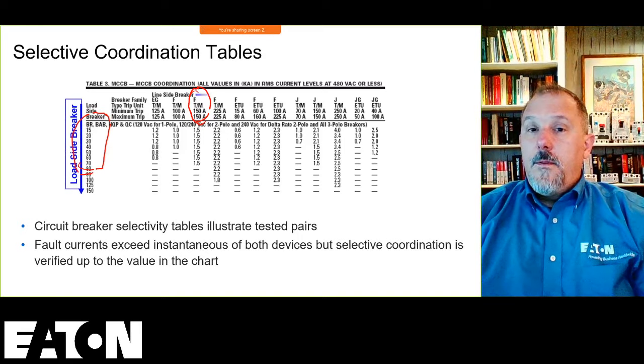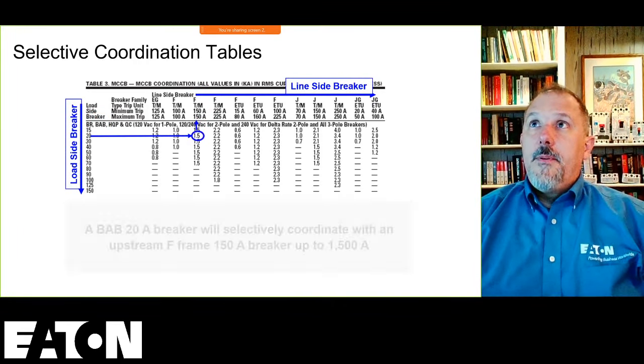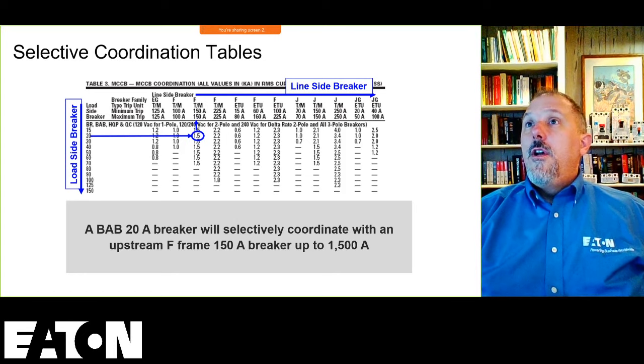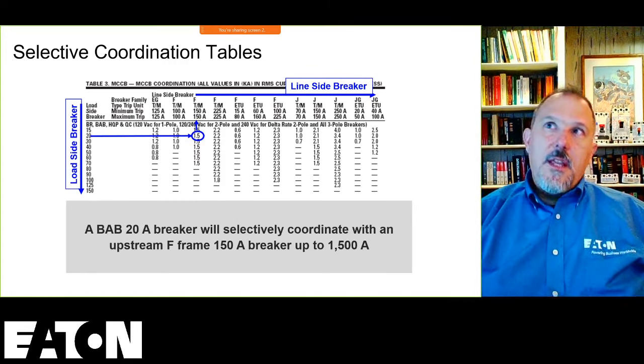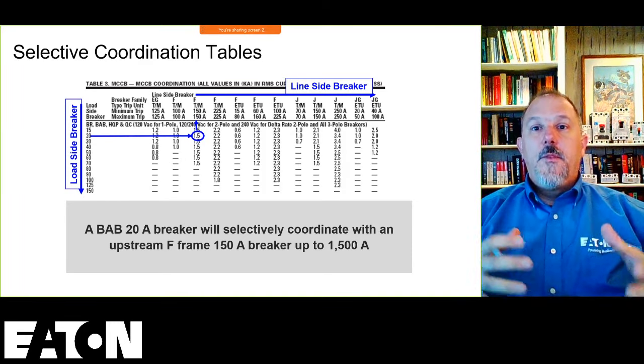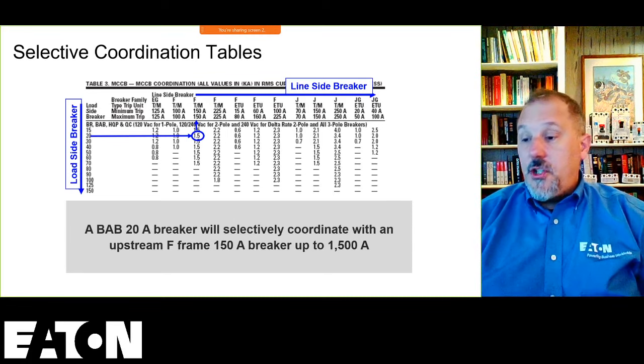All right. So I'm looking at the questions before we get into this. Bill Knightsoul asks: this allows engineering supervision in existing installations, and this could allow the engineer to design with different manufacturers. So you could. Here's the thing, Bill. When you're using different manufacturers' parts and pieces, you're going to be on the TCC curve. I mean, that's what you have. That's the only tool you have, a time current characteristic curve.